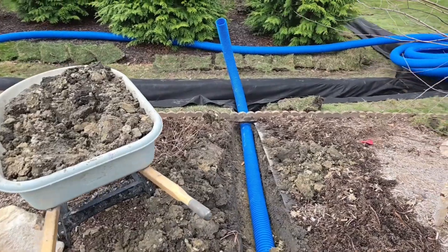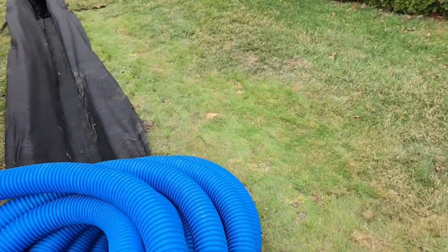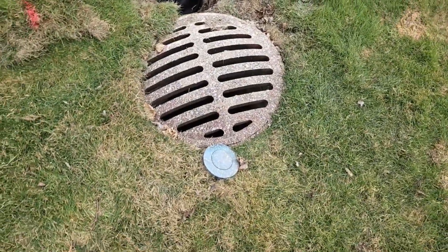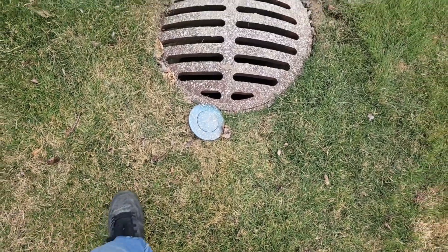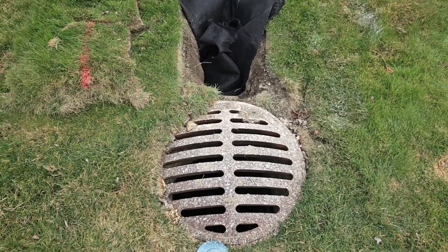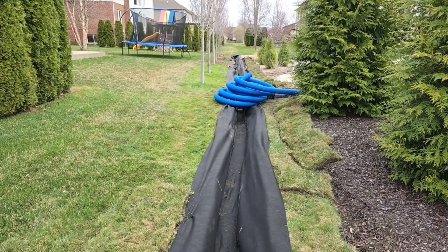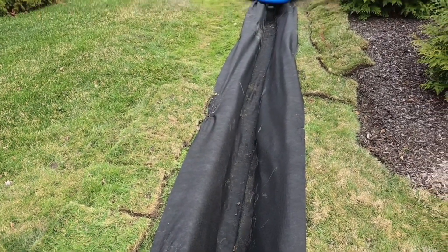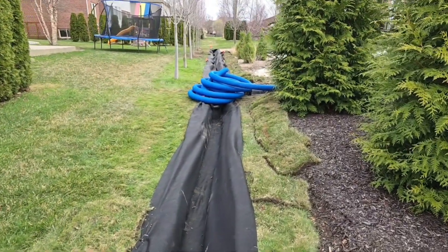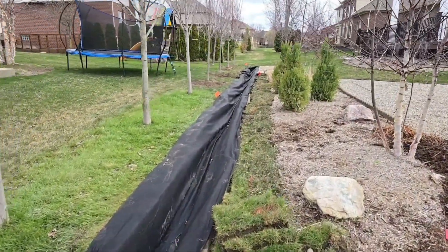They have a solid pipe that they're running in their trench. They're going to have downspouts on it, they're going to have this catch basin on it, and they're taking everything to a storm drain. There's going to be a perforated pipe and a solid pipe in this trench. They've already dug all the dirt out and they've already cored and tapped the storm drain. There used to be a pop-up emitter that just went to the storm drain and it wasn't enough — you have to dig down and core through the sidewall of your storm drain. Notice how there's no dirt on the side of the trench.